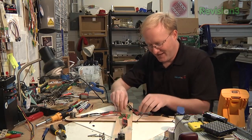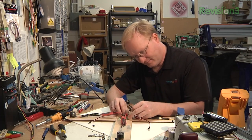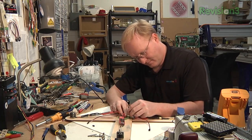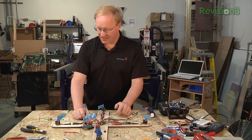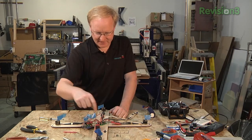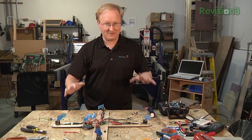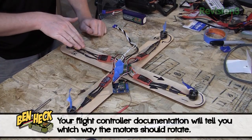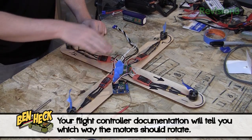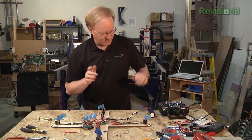It's a giant flying tongue depressor! We're ready to do a test with all four motors. I have them marked in the direction they need to rotate — they don't all rotate the same way because they kind of balance each other out. You can change the way a motor rotates by switching two of the wires on the three-phase connectors that power the motors.